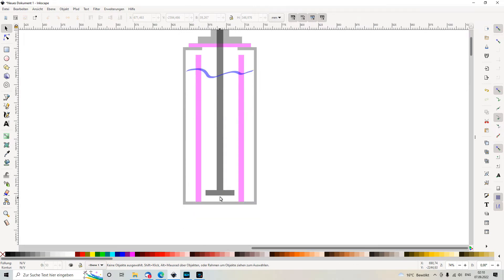The position of the threading rod is variable: if I turn it in I lower the distance to the bottom of the cell, and if I turn it out I increase the distance. The distance between the stem and the bottom of the cell represents the resistance — high distance means high resistance, low distance means low resistance. This tube here is a PVC insulator, because otherwise the cell would not work correctly.